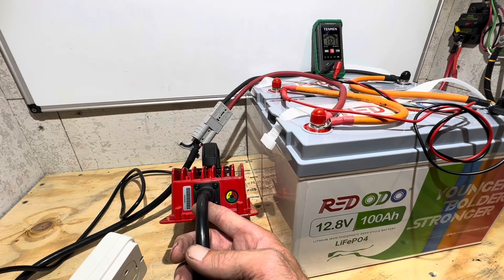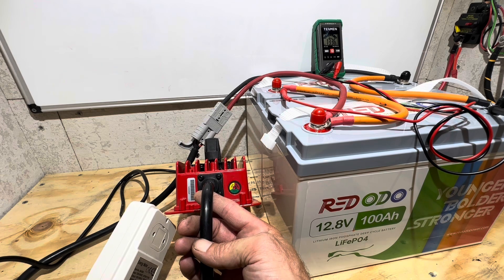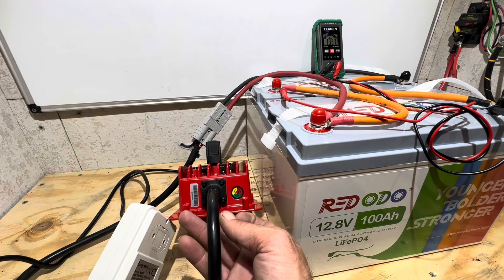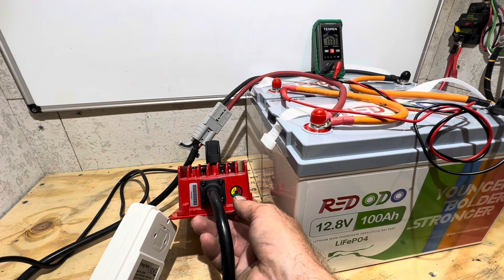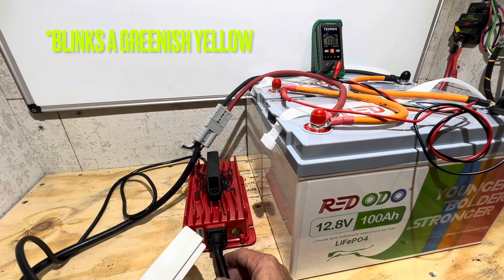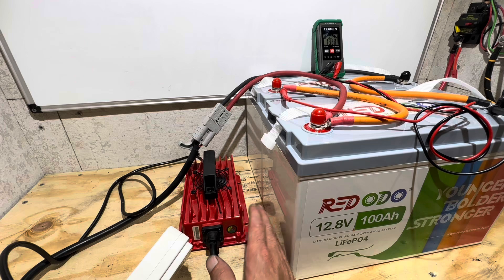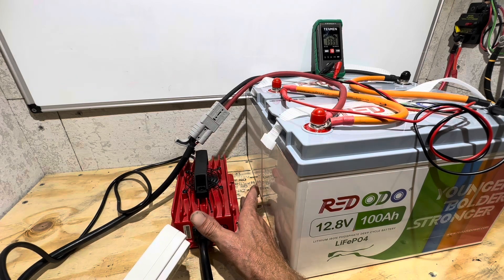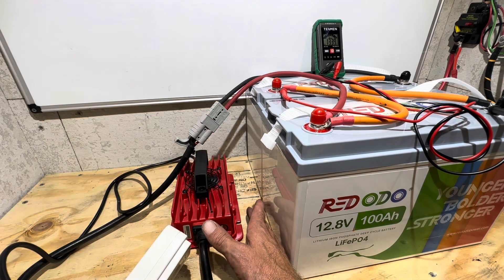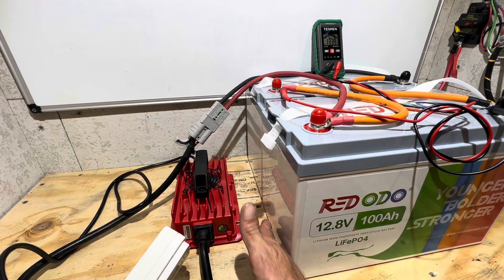A little fan comes on and there's an indicator light — blinking red, indicating I'm below 80% state of charge on the battery. You can see on the little meter that the voltage has come up from where it started. Once it comes up to around 90% state of charge, the light starts blinking green, and then when it's fully charged you get a solid green light. If you're using this inside, the case does get warm. The fan cools across the top fin, but the bottom does get warm, so I would not recommend sitting it directly on wood. Use a little spacer or some concrete board — the case has never exceeded around 120 degrees, but that's still a warm spot on a combustible surface.